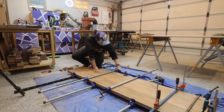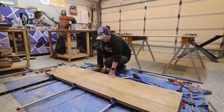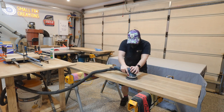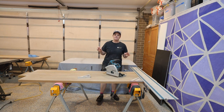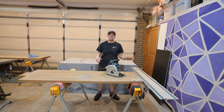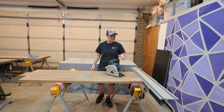With the smaller panels in glue up I could then get the larger ones out of glue and start rough sanding everything. With the sander in turbo mode and 80 grit sandpaper I could get the panels rough sanded in a matter of minutes. I've got the pieces rough sanded but before I spend any more time sanding things I may not even need, I'm going to cut the pieces to length and to width, and then I can concentrate on getting everything joined and sanded and looking nice.